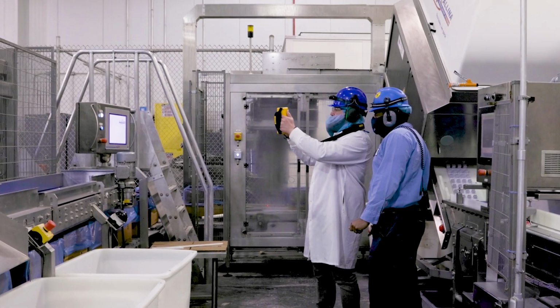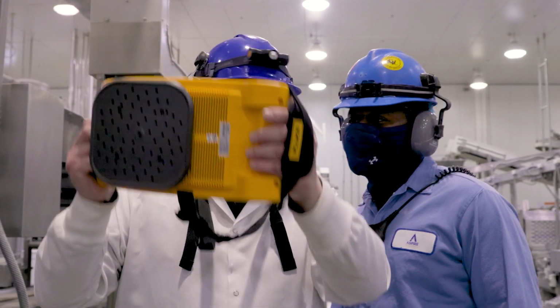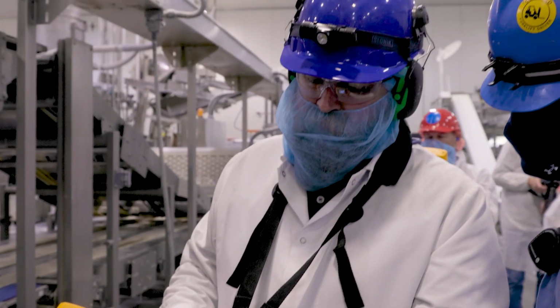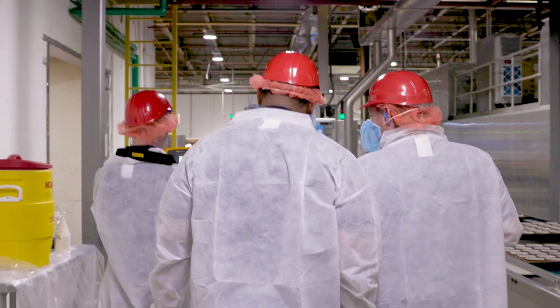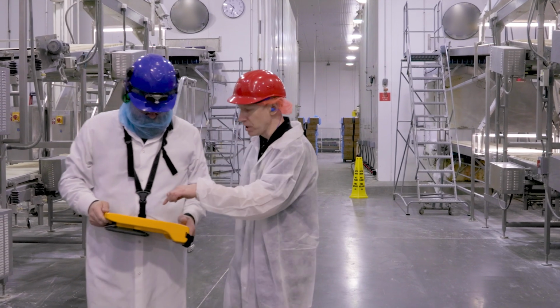So after an initial scan like this, a customer can expect to find 10 to 15% savings after fixing their leaks. And they can verify that by using Fluke energy loggers. The reason to use the energy logger is to see truly how much energy you've reduced from those air compressors after fixing the leaks. The goal of having these loggers is from two aspects.